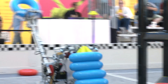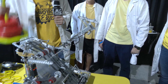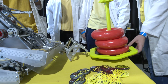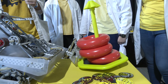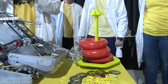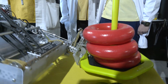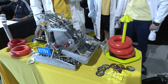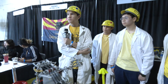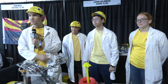An additional function that wasn't quite intentional but has turned out pretty well is the ability to grab mobile goals. If we lower the claw down and lift it up a little, you can see it gets into the lip of the mobile goal. It works best when the goals are empty because they're lighter, and best when it has more air — like at the beginning of the autonomous period. This allows us to rush toward the goal on the center tape line and grab it before anyone else can. It's going to be really interesting to see what mechanisms keep getting developed for that race to the middle goal.